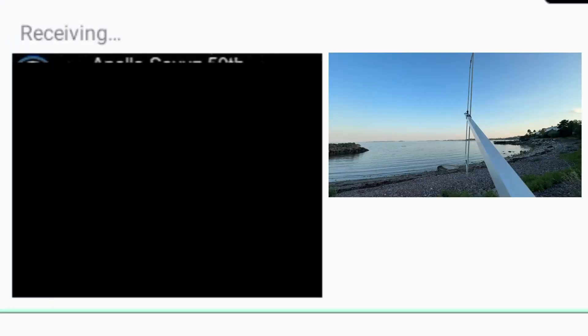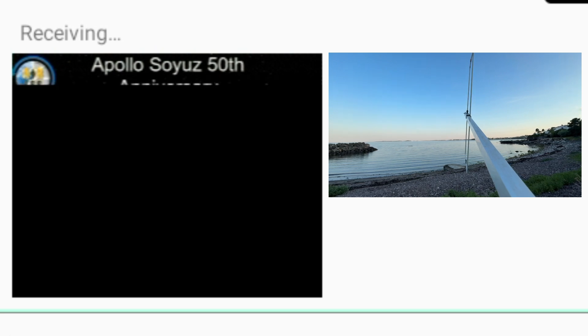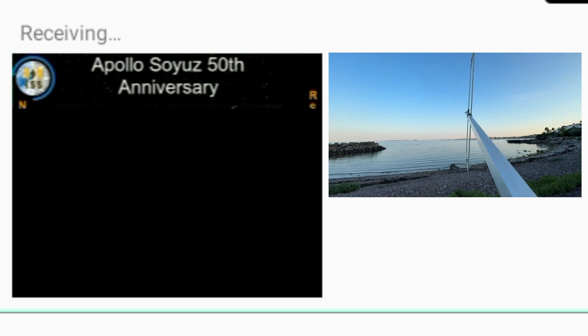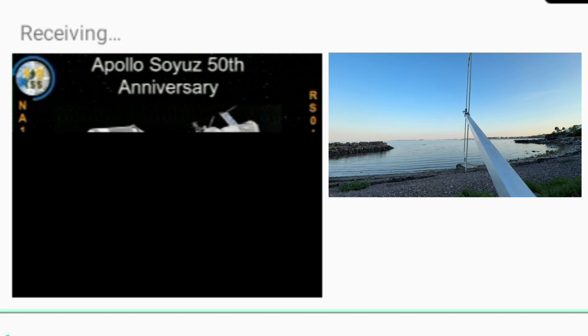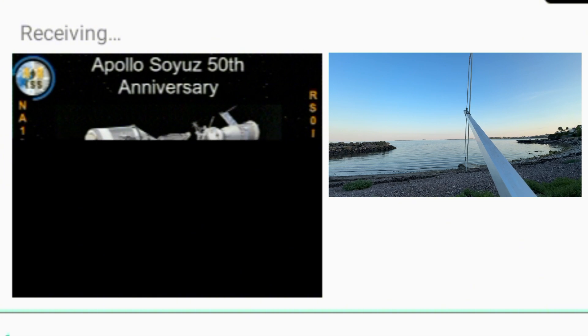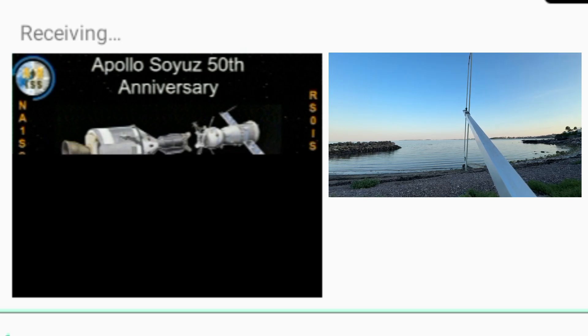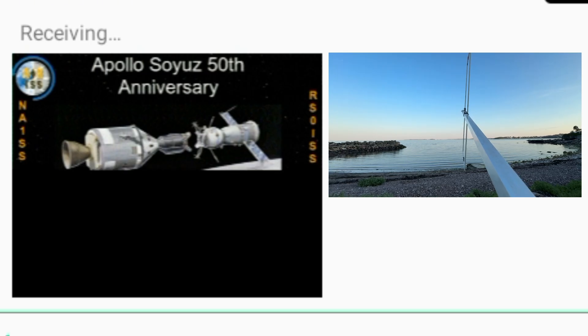Yes, that is most excellent. I see I'm decoding something. That means the application has muted the audio, which is a little bit sad because I would have loved to have it on, but I'll have to just use the signal meter on the microphone to guide me when it comes to polarization. It seems to be getting a better signal horizontally polarized, and I'll see if I can manage to follow the direction I suspect this is coming from. It's still between an S7 and an S8 for signal strength, and that's pretty amazing — and it seems to be decoding too.